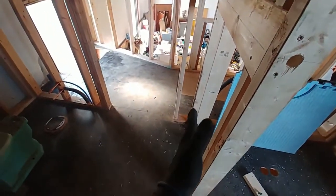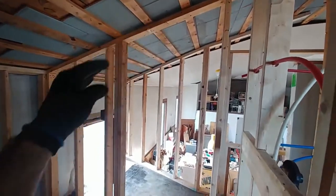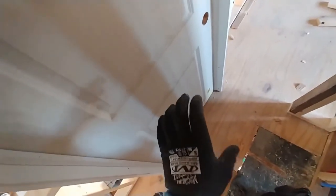And then I was looking at this door over here, which was a product of this wall's location and as high as it could be under the roof line to still function. My buddy got what looks like a deal on this for $50 or something on clearance, but he took everything that he needed off the bottom of it, which meant that that lower rail is getting to be so visually narrow. It's actually narrower than the top rail, which as doors go in millwork, the lower rail is normally heaviest, and then the middle and high sometimes descend in width or whatever.